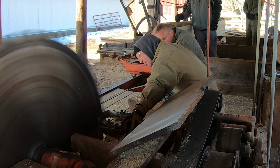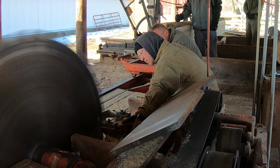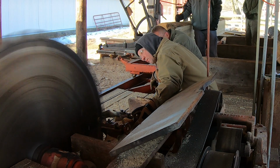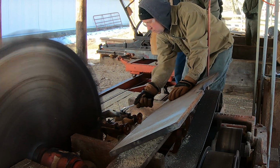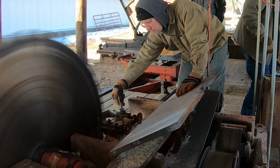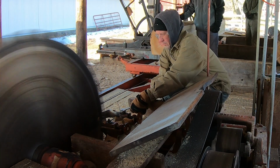Additionally, what you don't see is I block off the carriage so the carriage can't move. We take a big piece of wood or piece of metal and put it in the pulleys so it's not going to move. And what Doug is doing now is adjusting these guides, and they're just maple wood impregnated with oil, to be a business card width away from the saw blade, according to AKA Frickin' Jeep, Mr. John.